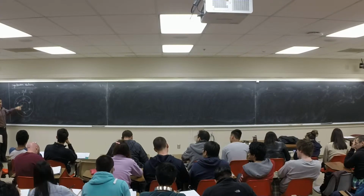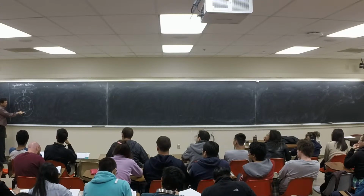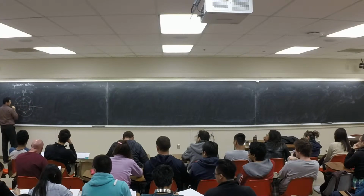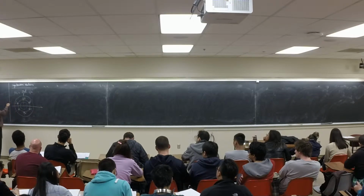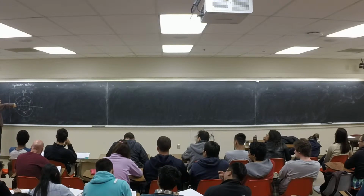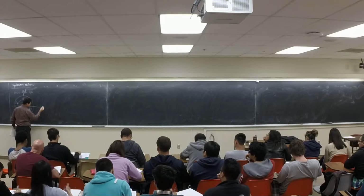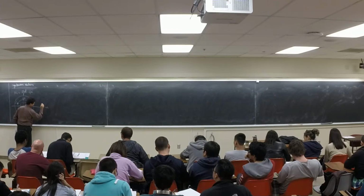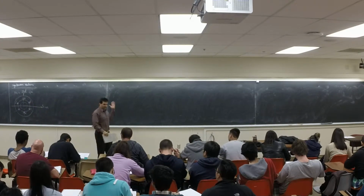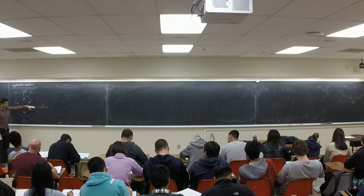Now, what's the magnetic axis for this phase? Magnetic axis, if you look at it, see this current is going to go here, come here, going here, right? So basically, if you look at it, the flux is going to be like this. Let me see here. It's going to be like this. So the current is coming like this, right? You put the thumb in the direction of the current. This one is going to show you what? The magnetic flux for phase A, right? So we call this one the A axis, or phi A axis. Let's call it phi A, the magnetic flux of phase A. Right? This is the flux of phase A.